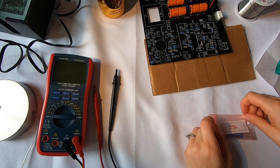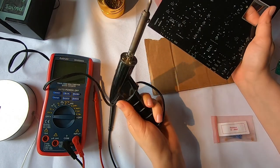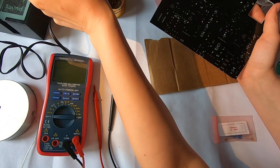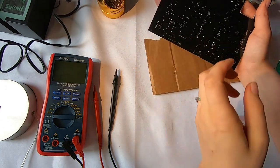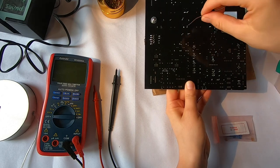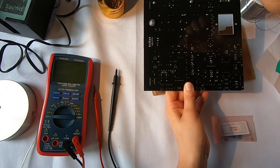But other than that, the only other thing that I'm finding helpful is when I go to actually solder these in, I'm taking the tip of the soldering iron and putting it right up against the junction between the resistor wire and the hole. Then I slide it up that wire ever so slightly so that when I touch the solder down, it's going to be hotter faster and melt faster because I just touched the junction point, but also the soldering iron isn't directly over that spot, so it doesn't cause a little whipped cream peak in my solder.